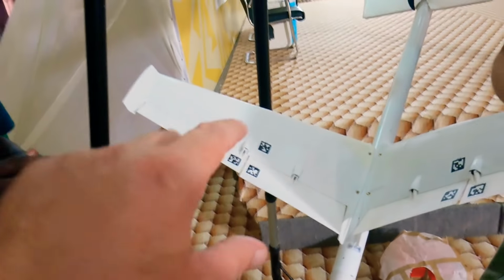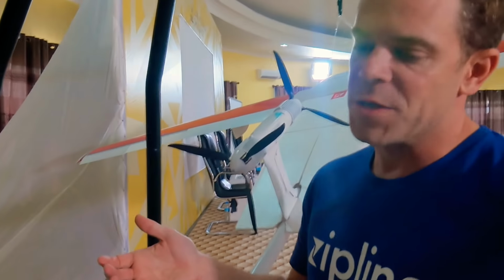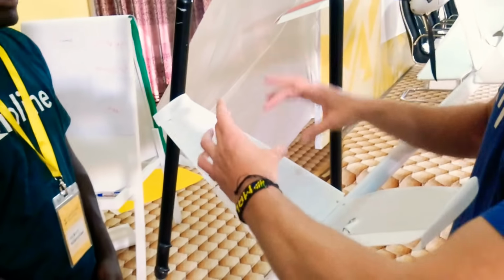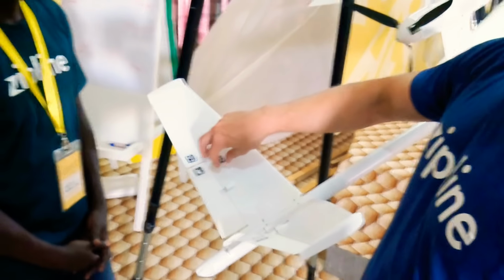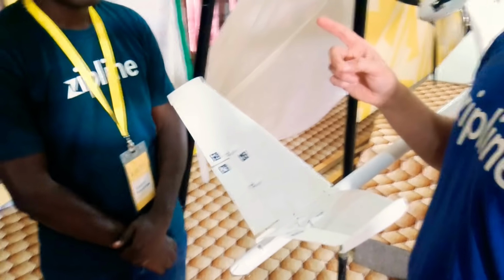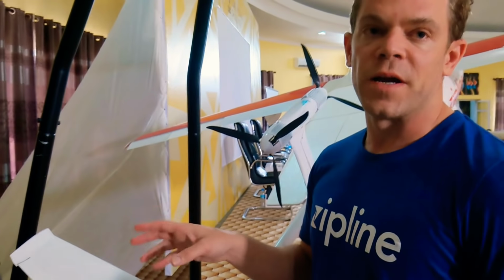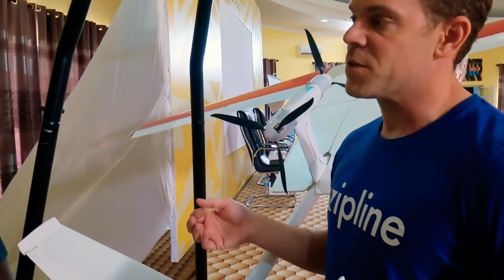Yes. And then the app, explain to me specifically what happens. We call them magic wands, but they're iPhones with a certain application that we use. When you look at the QR codes, it looks like just a camera screen on your phone, but you'll see the QR code, and then you'll see in augmented reality a green cube over top of the QR code. That can measure all the movements and the deflection of the control surfaces. But the other important thing is that the cube can measure micro vibrations that the human eye can't see.